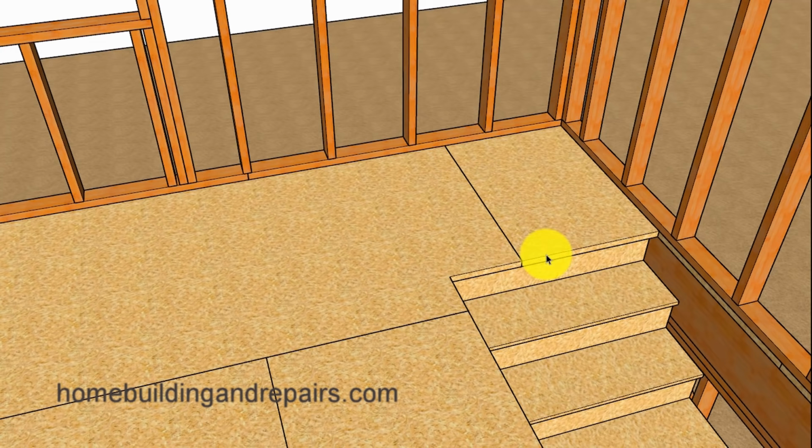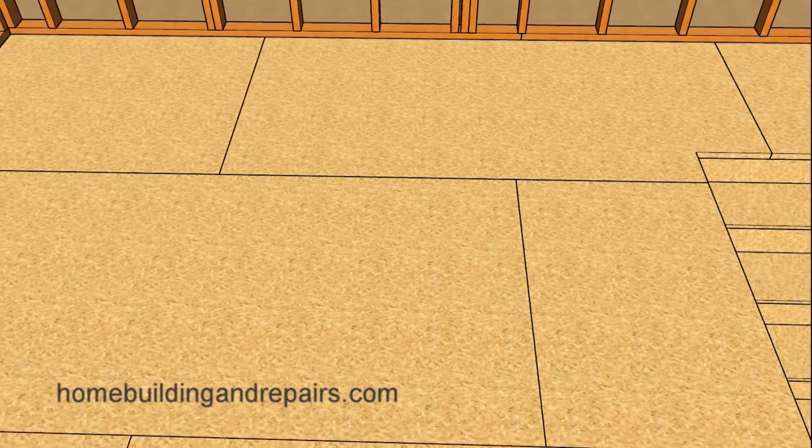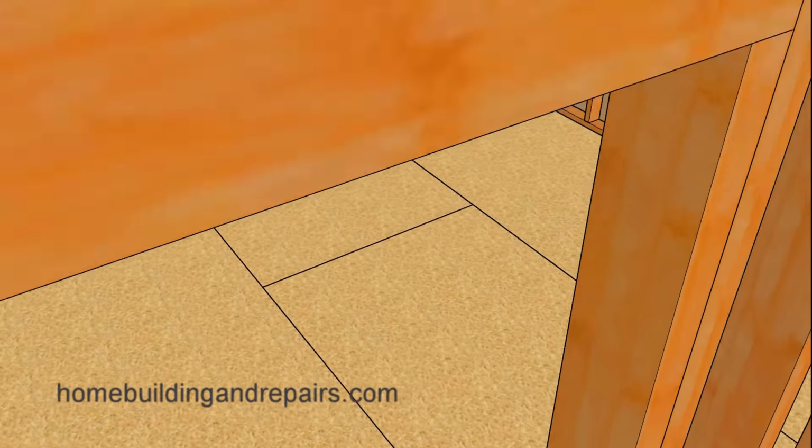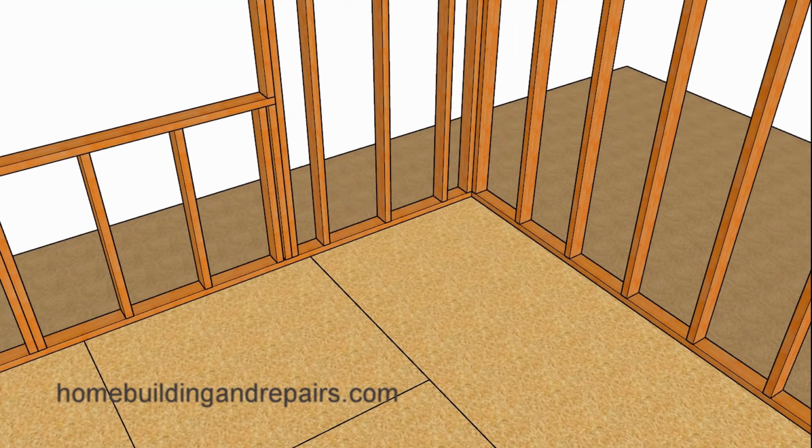And of course, our stair landing or upper part of the floor, this needs to be at least 36 inches for most buildings like these. And I believe most building code books refer to the length of this right here as applying to a building with less than 50 occupants. A view of the bottom of the bedroom door, corner of the bedroom framing.